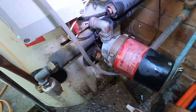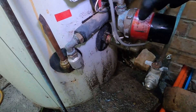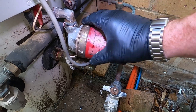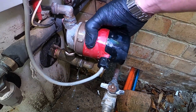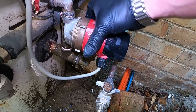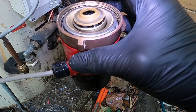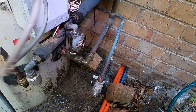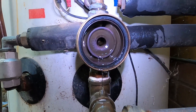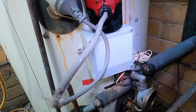We'll just take that off and show you what it looks like. Inside the pump is a little spinning impeller that's magnetic, sitting on the magnet coil. That just sits in the housing and sucks the water in from the center and spins it out to the top. It didn't actually have any water in it so it probably wouldn't have run too well.